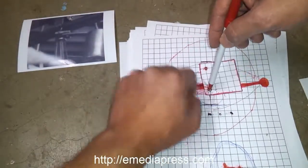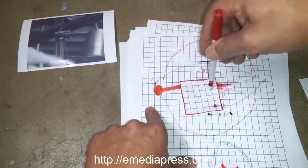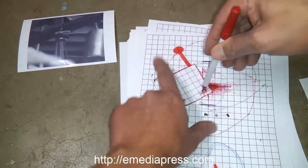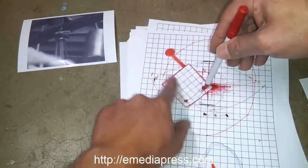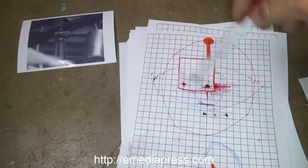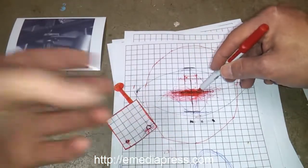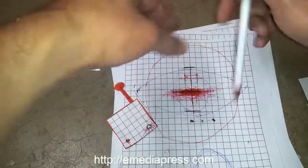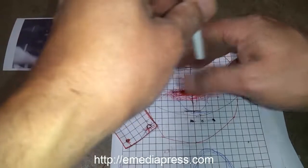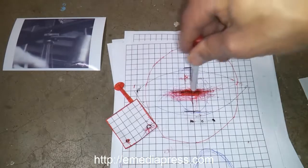Okay, goes like that. The center is always moving, and for the most part it's back and forth. And with the lever up here, there is a little bit of this kind of motion to kind of encourage it, but you can do that in a whole bunch of different ways. I don't think you need the extravagant pulley setup on top. I'm looking at basically a Scotch yoke where I can take rotational movement and turn that into a back and forth like this. And I have some big super balls that I was going to have on both sides to basically act as springs, but it gives it a little bit of this motion too, so that it's not pinned just back and forth. It actually can rotate a little bit.